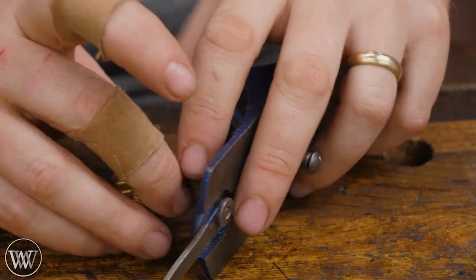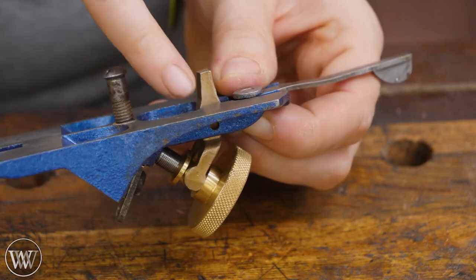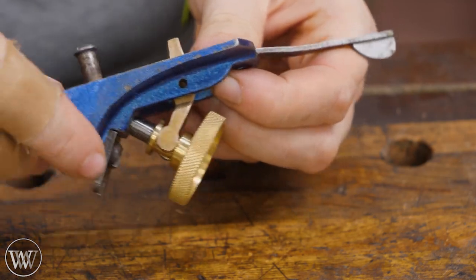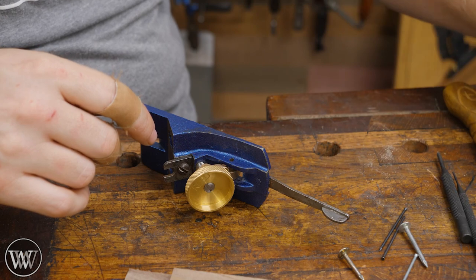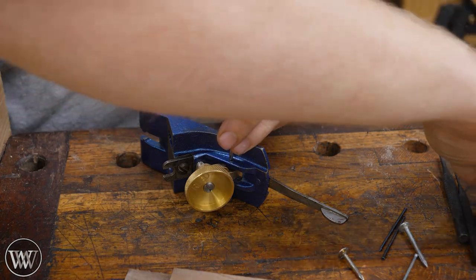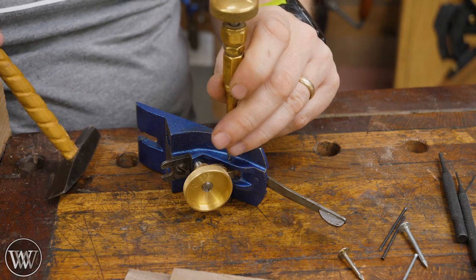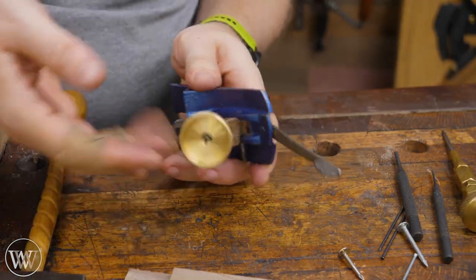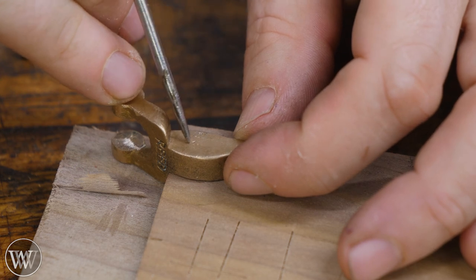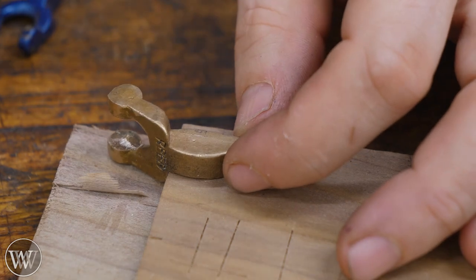Make sure the yoke is fitting down in there, then slide it all into place. You want to make sure the yoke is sticking out at 90 degrees to the frog and the meat of the body is in line with the hole. Once that's in place, we can mark the hole — that can be done with an eight-penny nail, a center punch, or an appropriately sized awl that will fit the circumference and give you a good point. Give it a light tap and that will mark the center so we know where to drill. We now have a spot exactly where we want to drill.